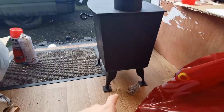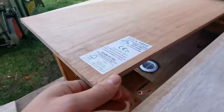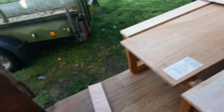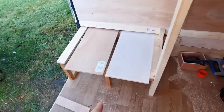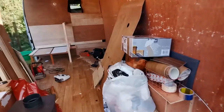I spoke to my friend Brett about cutting holes in the tile to put the log burner legs through, and he said just don't bother — it's going to be a nightmare and you'll probably break the tile. So instead I've got some 12mm ply and I'm just going to sit this under that tile, drill holes in the tile, and bolt through into the supports for the log burner legs. Hopefully today I'll get the tile drilled and on and the log burner in position. The tiles are so cool — they're like £7 each, but you have to pay about £17 in delivery because they weigh so much. But they're stunning.